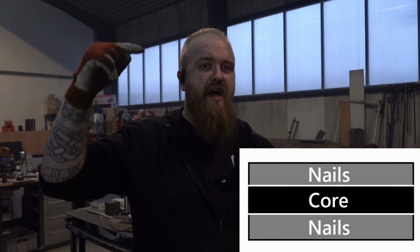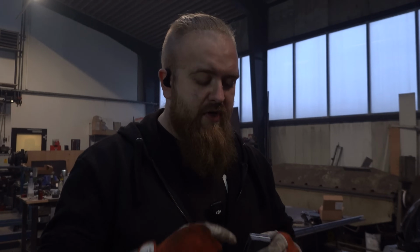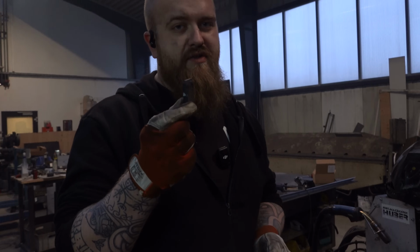Stack it: outside layers, pure nickel, core, pure nickel, outside layers. So a classic Sanmai or Gomai build. I'm now gonna weld on the ends, put a little piece on for our tongs, and then classic forge welding.